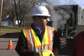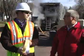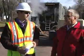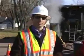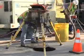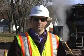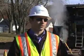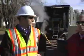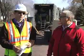With the old way we used to replace sewer pipes we had to rip up the whole street — how much tear-up is involved with this process? Ultimately zero. We're entering each line from the manholes, installing from the upstream manhole down to the downstream manhole, so theoretically you have zero invasiveness to the surface.